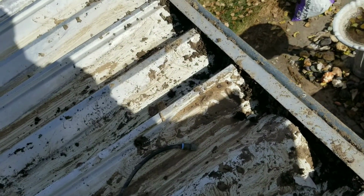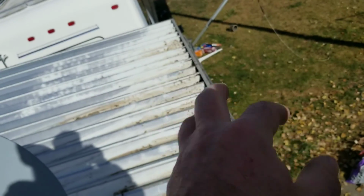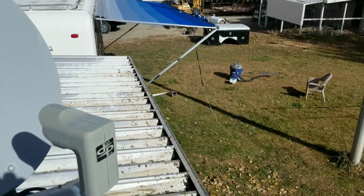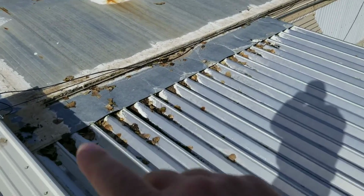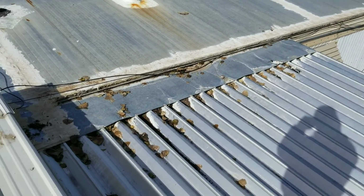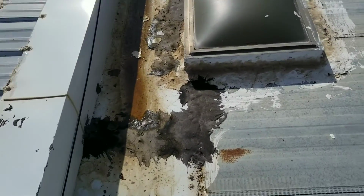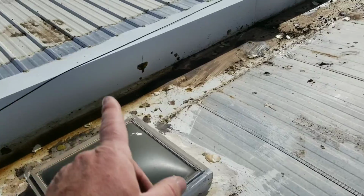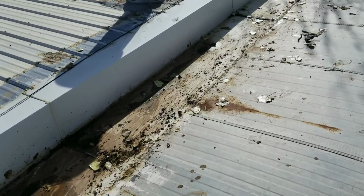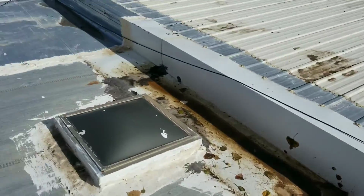So I got to pull the fascia on that. But the gutter is also what supports the awning. The posts support the gutter. So that's a project. Got to get up under these eaves. Those are all packed full of mud and dirt and everything like that. And there's a step in the roof. The roof leaks right here. And this was all packed full of mud, so we raked all that out, scooped all that out. I gotta clean it off, find the leak there.